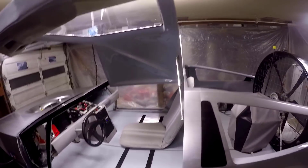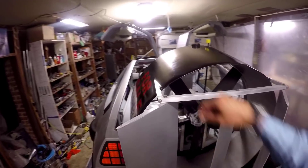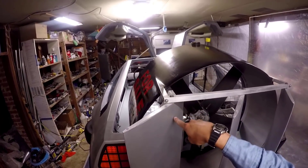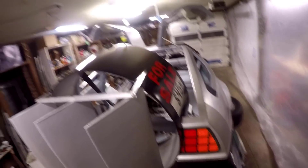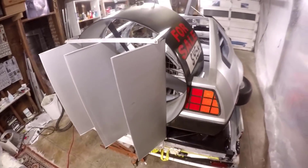I got new stainless steel door lifts. These rudders are brand new — I made them stronger than the other ones. These bolts can be removed; they're threaded into an aluminum tube with a bunch of thread locker, so you could remove them if you needed to, but they should be really solid. The whole rudder system can be removed if you take out these four nuts and undo the turnbuckle that tightens the steering cable. You can just pop the whole rudder system off, like if you needed to get the fan out or anything like that.